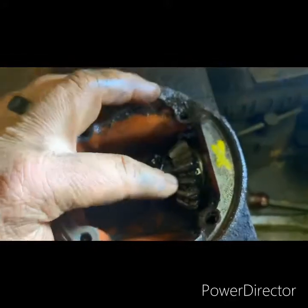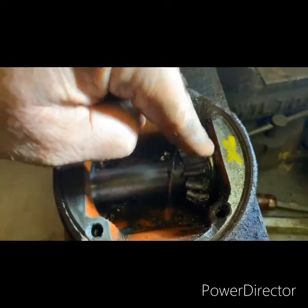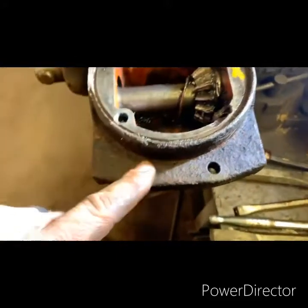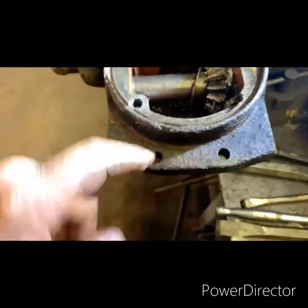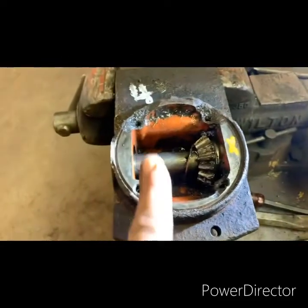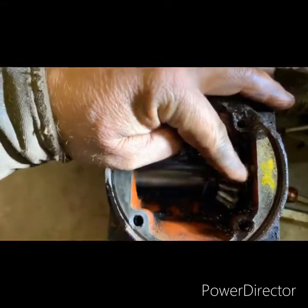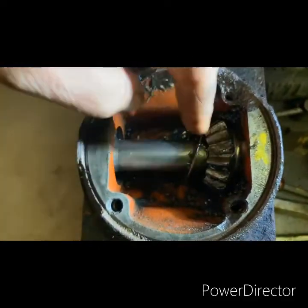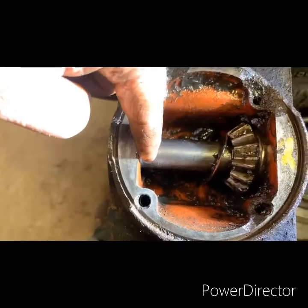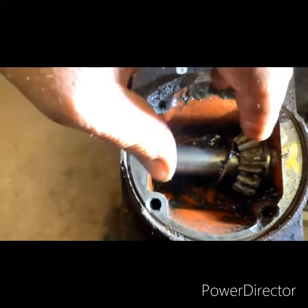On this one I marked which side the gear was going to be on. By putting this gear on the right-hand side — and you can tell that by these two bolts right here which hold your rock guard on — this is the direction of travel. So when you're cutting, the hay is going to be coming in this way. By having this gear on the right-hand side, that's clockwise, the way your turtle is going to spin. If you put that on the other side, your mating gear comes down and that will spin your turtle counterclockwise. It's the only way they reverse them.